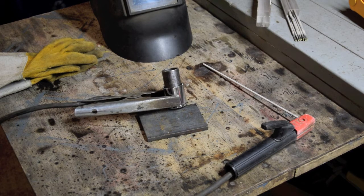We're all set up to weld the socket to my pipe there using a stainless steel rod, and it looks like I'm going to be doing about 80 amps here on an AC, not a DC feed.